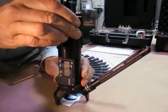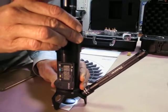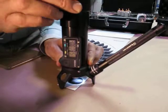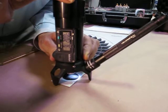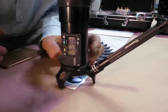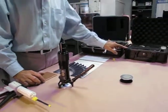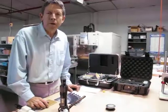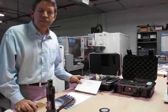I'm able to find the top of what was a scratch — is now a ridge — and I'm going to set zero on that, and then focus down to the surrounding material in the background. I got 21 thousandths, so that's pretty good. We're able to have quite a combination of the micrometer with the replicating compound — we can get almost anywhere and measure the depth of a scratch or corrosion pit anywhere on an aircraft component. So this is the replicating compound, 4400K. Thank you very much.